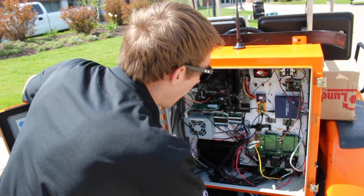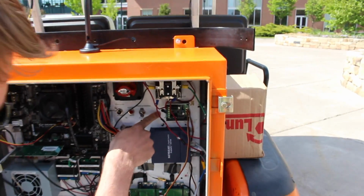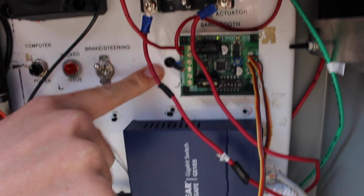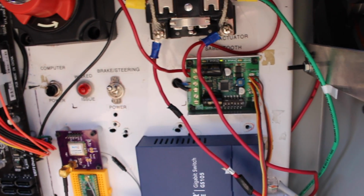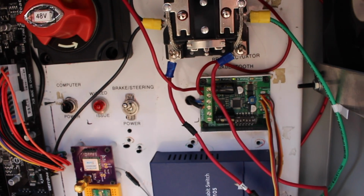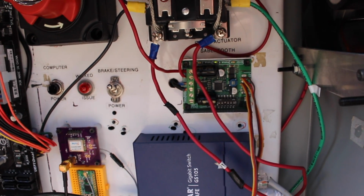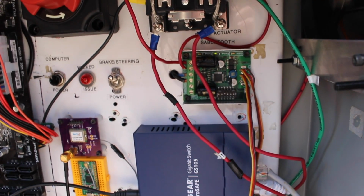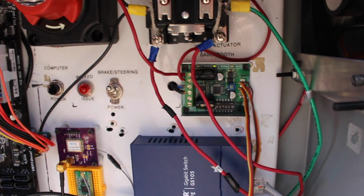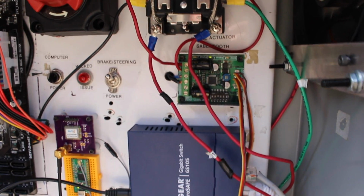And how that's working on the Sabertooth and how that's configured is that it changes the polarity on 4 wires, but really in reality it's actually 3 on the actual actuator. And by changing the polarity, you're able to either retract or extend the actuator. You can see the theory of operation manual for how that circuit actually works and what combination of what wires, what polarity causes the actuator to do what it needs to do as far as extending and retracting.